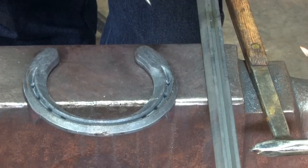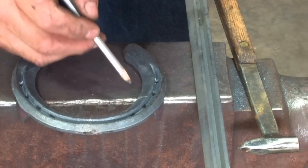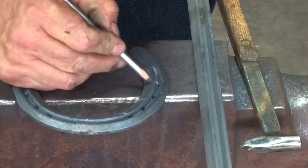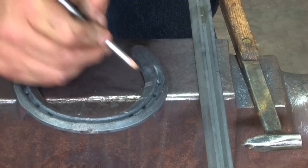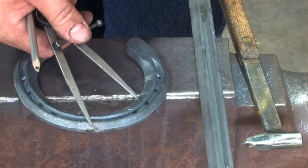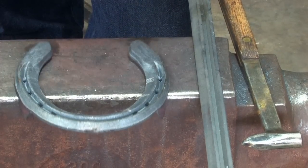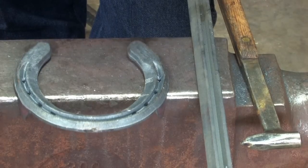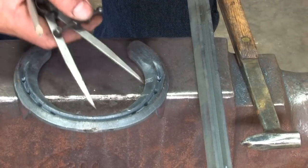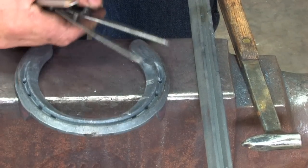If they tell me it's a three nail hole pattern per branch and then tell me where the clip's going to go — whether it's between the first and second nail holes or otherwise — I'll measure and that'll tell me where my bob punch mark has got to go. Then I'll put one nail hole in front and two behind. I won't know until I get to Calgary, but that's how I'm going to work it out. Right now I'm going to do a three nail hole pattern with one nail hole in front and two behind.